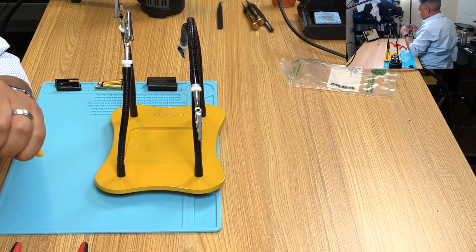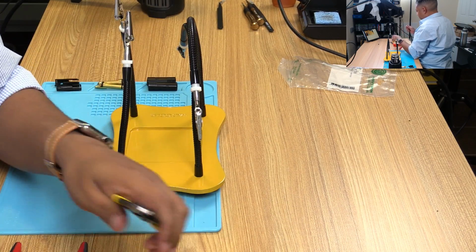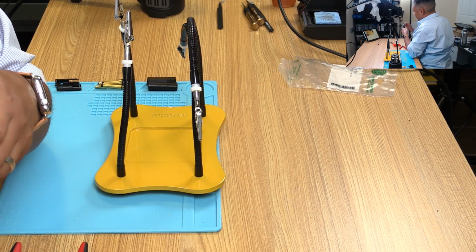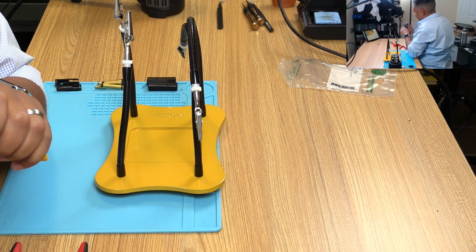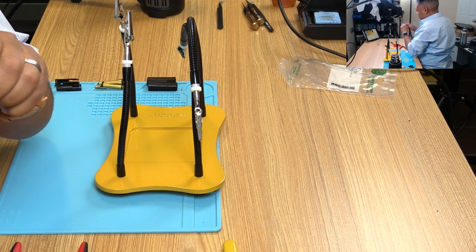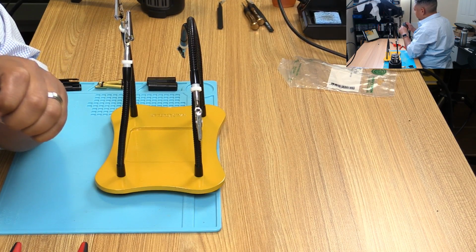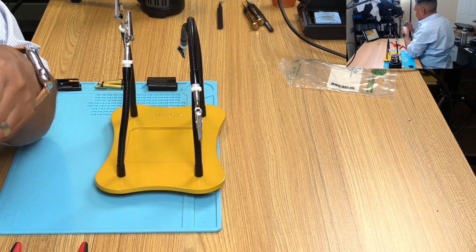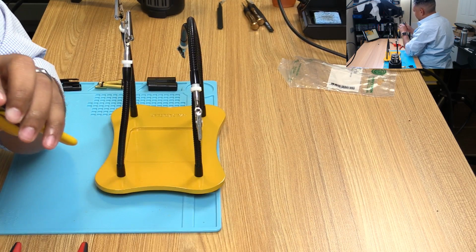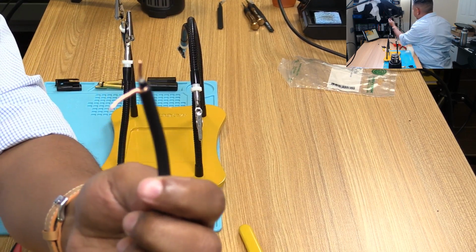Hopefully without... I don't know what the inner gauge is here, so I'm trying to be really careful. I suspect it's 14. I should actually look at the website. I'll put it in the description. Yeah, that's about right. Looks like 14 is about right here, at least as far as the stripper is concerned. Rock it gently. Looks like I might have got it there. And then I'll go back down to 12 so that I know I won't cut into it. There we go. Alright, got that guy off.